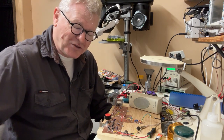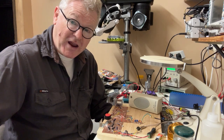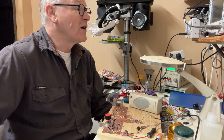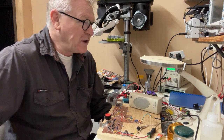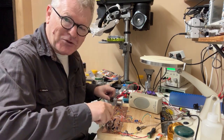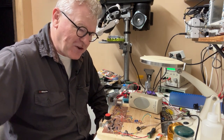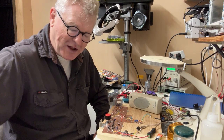Another thing I learned is that you should use the times-10 switch on the oscilloscope probe. I hadn't thought that was necessary — my scope says it's a one megaohm input — but what I hadn't considered is all the lead capacitance. We've got a bit of storm activity here breaking through, but using the 10X probe actually makes quite a big difference, and I think lead capacitance is the answer there.